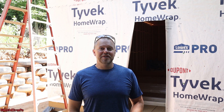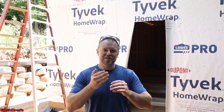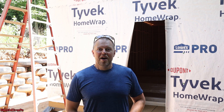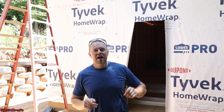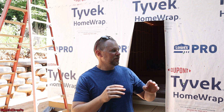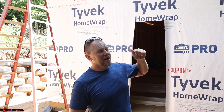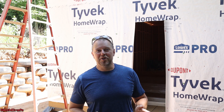Now it's time to move on to the soffit. I'm using a smart soffit which is basically just OSB with slits in it and I have to rip this down to the length and width that I need. I'm going to start with the gable side for the front and back because my building is slightly longer than 32 feet — if I were to do the sides first I would come up short by a couple inches. So let's step up the ladder and measure this side to see what we need to rip this soffit material down to.